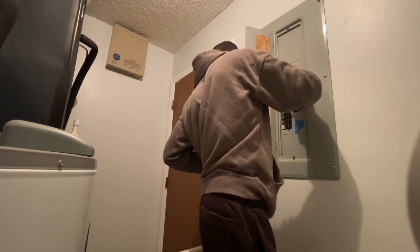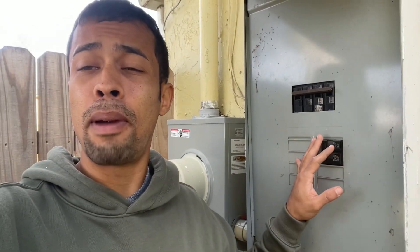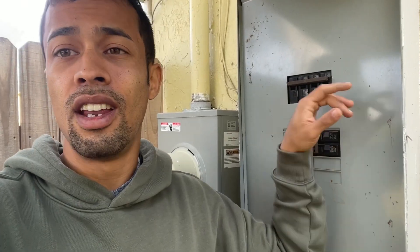That's it for this video — I hope you enjoyed this quick tutorial on how to safely open an electrical panel. Before I let you go, always inspect the panel for prior damage: loose wiring, a missing circuit breaker, or signs of previous arcing. If you see any of those, always take the proper precautions, and it's safest to not open the panel at that point.